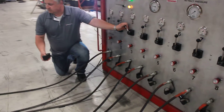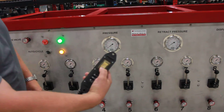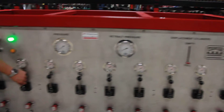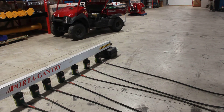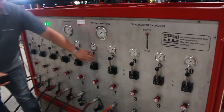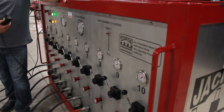Once contact is made, we're turning that to zero and moving to our third cylinder. Once the displacement cylinder has been emptied, we again hit back to neutral and refill the displacement cylinder. Back to the advance, we continue to bump our cylinder. You can achieve this quickly by sending all cylinders into the advance slot, then hitting retract on our pump with our displacement cylinder, which will send low pressure oil to all cylinders.